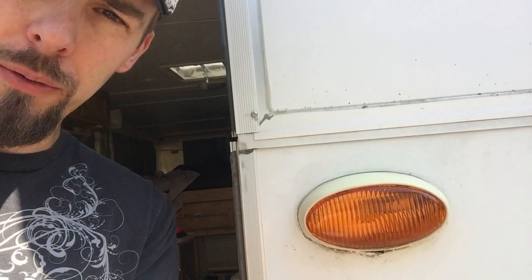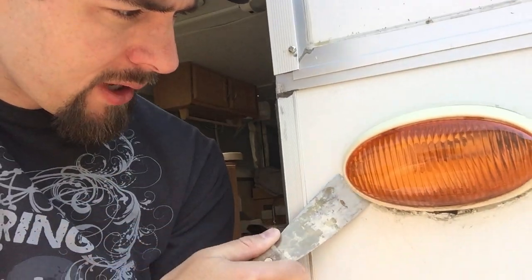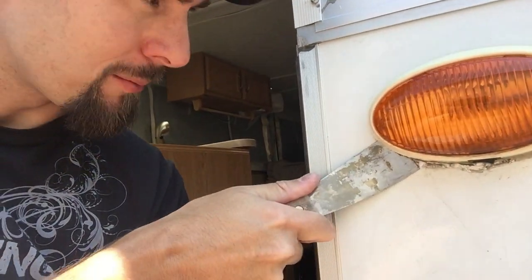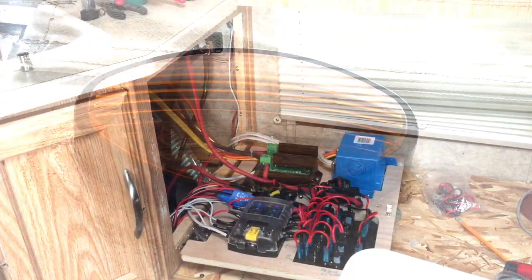As a side project, I'm going to replace this light fixture with an LED fixture. There are some screws I need to remove inside the box, so I've removed the cap, sprayed it with some WD-40 — I found that WD-40 really helps loosen up the sealants — and then I'm using a putty knife to go around the edges and work it in there. Just like that and pop it off. It came off pretty easy, so I'm going to put the new one on. Before I do, I'll use some rubbing alcohol to clean up the area, put some sealant on, and then put the new unit on using all the old wiring on the inside.